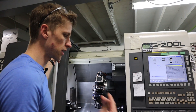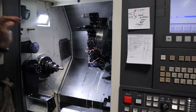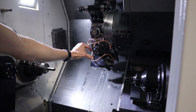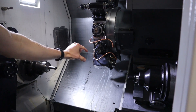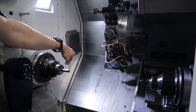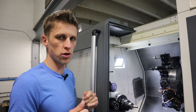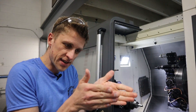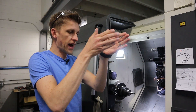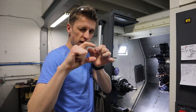Let me show you some of the setup in the lathe. I'll rotate the turret. We have this 5/16ths 4-flute Lakeshore Carbide end mill. Notice how far it's sticking out of the tool holder — because when it comes down and starts machining, the collet nut has to clear the spindle. It's pretty rigid but chatters and vibrates a little. I was wondering if I could get a half-inch shank that necks down to the 5/16ths end mill at the bottom, so the extra room where I just need clearance is bigger and less vibrate-y, and the actual cutting portion is only the smaller diameter.